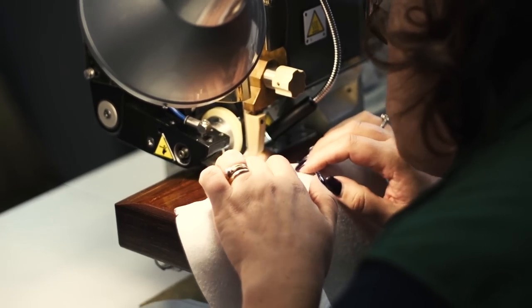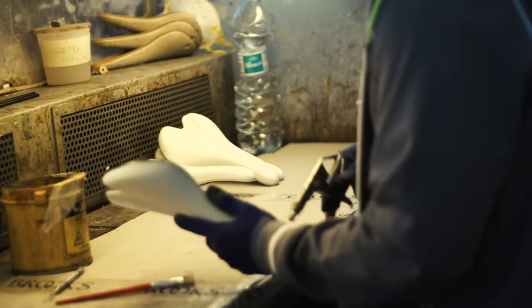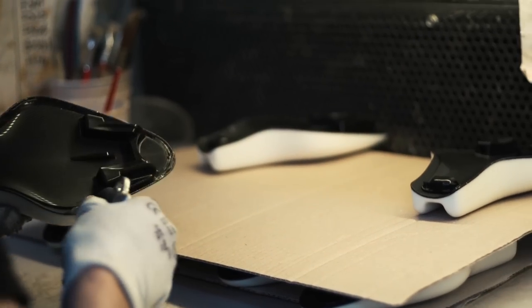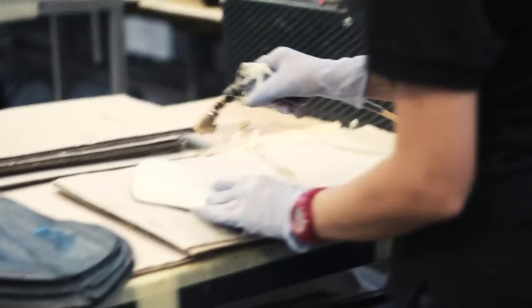On some covers, a laser machine is used to remove small parts of the cover. The next part of the process is to clean and then glue the top of the saddle mould. Each one is then allowed to dry, before another layer of glue is applied to the underside of the cover, which is then placed centrally over the saddle.